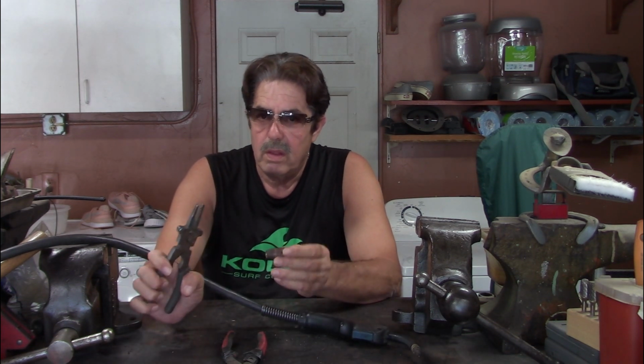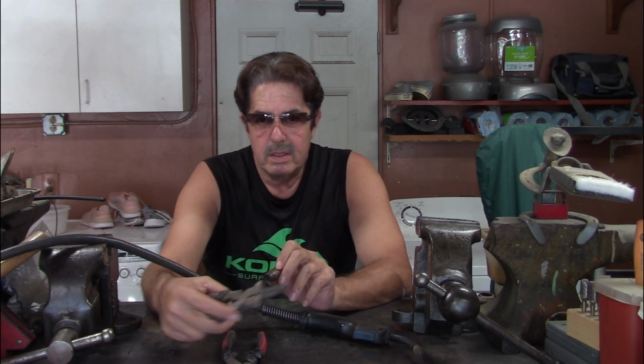So those are a couple of uses, and that's why I use the anti-splatter. Also, if I have a project, I spray some on there, because those little nibs you get sometimes stick real hard, and you have to use a 4.5-inch angle grinder and a flap wheel to get them off. A little bit of a hassle sometimes. With the anti-splatter, I just take a pair of pliers and hit it, and all those little nibs just come off. Then I start worrying about prepping the metal for primer or whatever I'm doing.